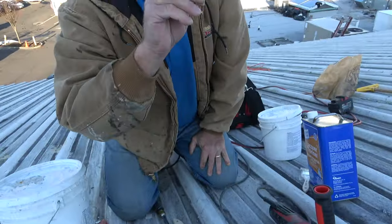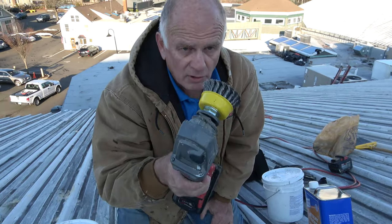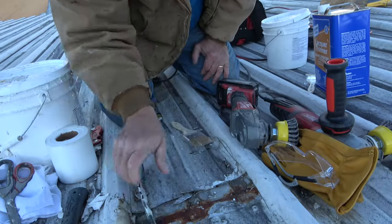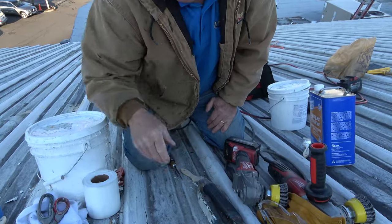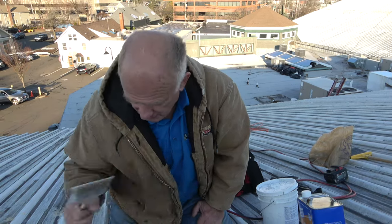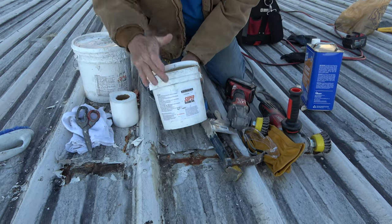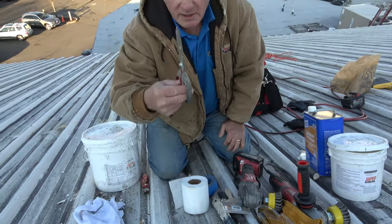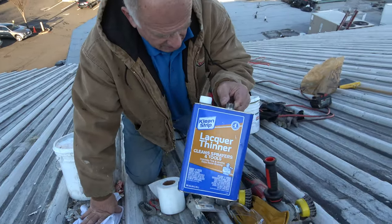You're going to need gloves, and you can never work without glasses when using the wire brush — otherwise you'll lose an eye. You can use a battery-operated grinder for a fairly small job with just a few seams and screws. You'll also need a flat bar, a hammer, disposable brushes (you cannot clean them after use), super silicone seal, the polyester fleece that comes with it, scissors, rags, and lacquer thinner.